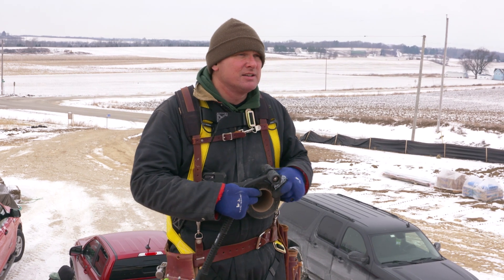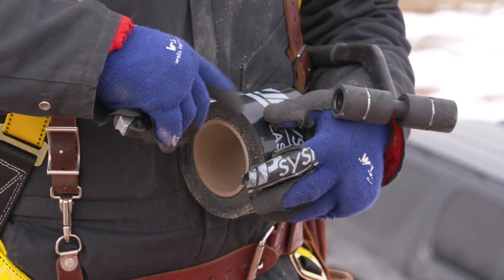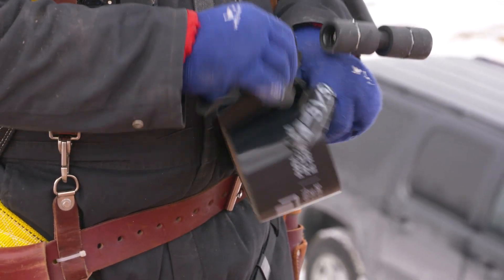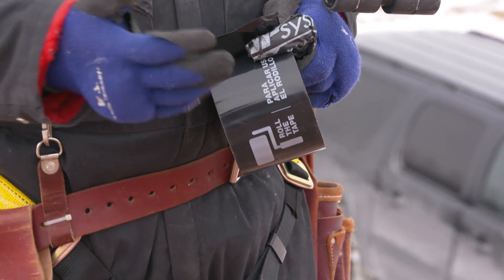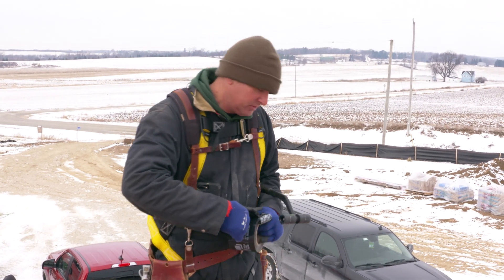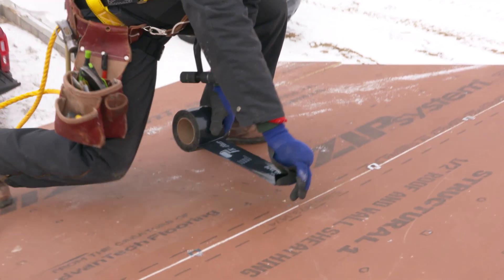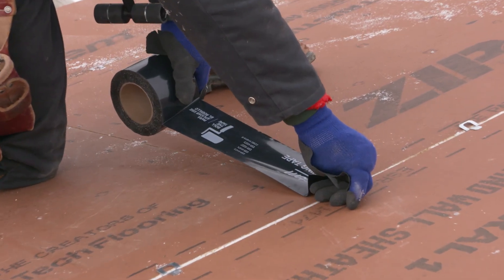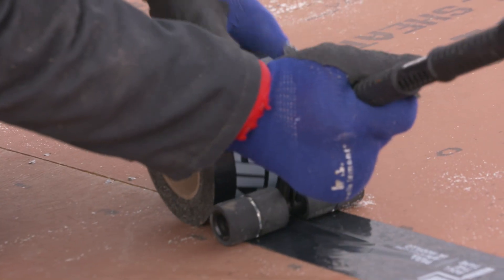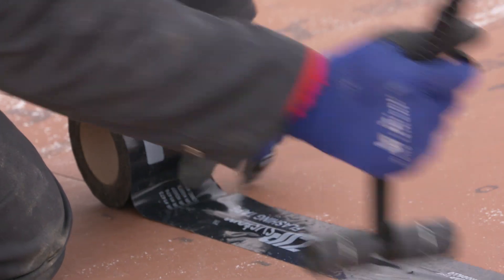Now that we've got the zip sheathing down, we can tape all the joints on the roof sheathing. I want to make sure I don't have any reverse laps, so that it's shingled properly like you would have your asphalt shingles on a roof. I'm going to start with this first vertical seam, trying to get the tape centered on the butt joint of the sheets, following the lines that are painted on the sheet to help guide me down.